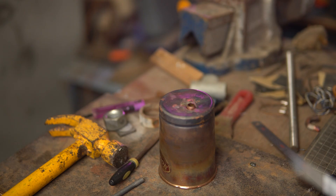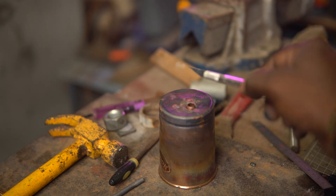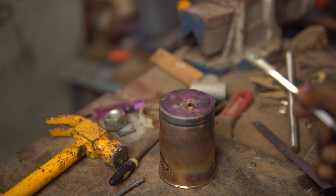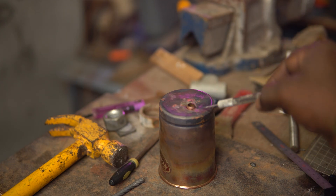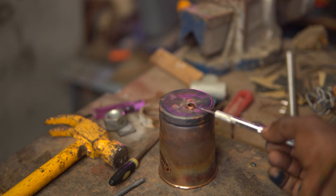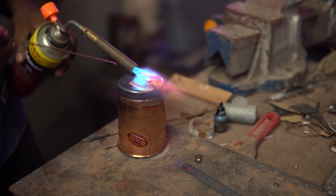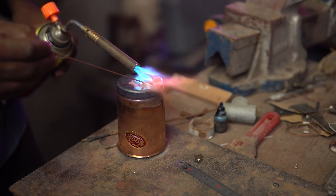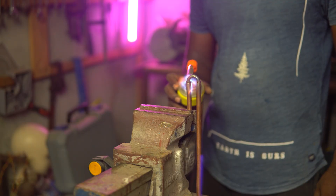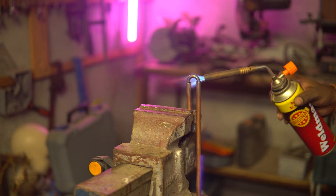I used super glue to temporarily hold the tube from inside the cup and started brazing the outer edge of the tube. In case you are going to attempt this project, I would recommend leaving this pipe a bit longer so that it will have a grip and you will be able to weld it properly. I made that mistake — I cannot go back now. So what I did is make a little divot here so that this portion sinks in, giving a little leverage on the pipe. Despite many attempts, the weld was not strong; the pipes would come loose or sometimes have leaks. At this point I realized it was not going to work, so I decided to repeat the steps but with a longer tube on one end this time.